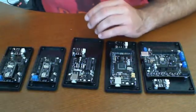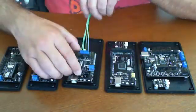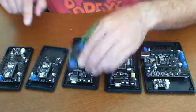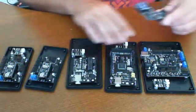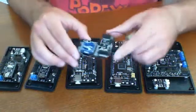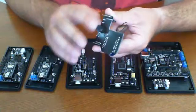Shield-friendly means that you can purchase various shields. Like this is an IO expansion shield, which easily mounts right on top of this here and gives you all the ports you might need. Furthermore, you can get additional shields like an XB shield, like this one here, and it mounts on top of just about any of these. These last three have shield support, whereas these do not. Whenever you see the term shield, that's all they mean — just one of these shields, usually indicated by one of these connectors here.